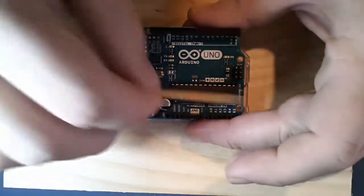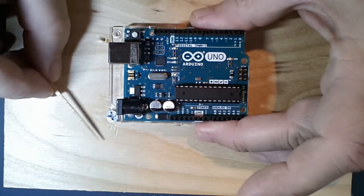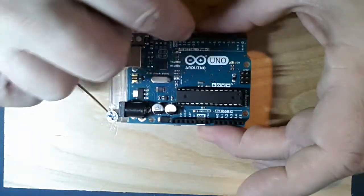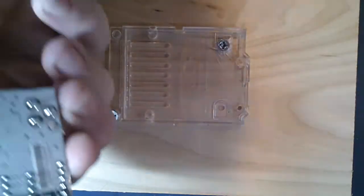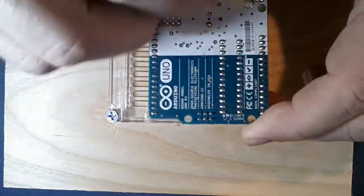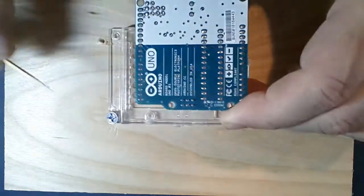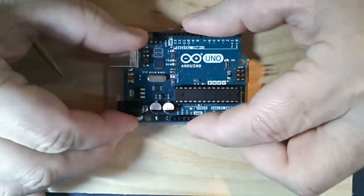It's a little more involved than the old days of hand soldering or wave soldering, but we can get smaller pitches and more components more cheaply. After reflowing the surface mount components, another pick and place machine puts the through-hole components on the board. Then it goes through wave soldering - like a bubble of liquid solder almost like a little waterfall. The board travels right over that liquid solder and it sucks up to the pins perfectly. Through-hole is a simpler and older process with less density, but there are still uses for it.